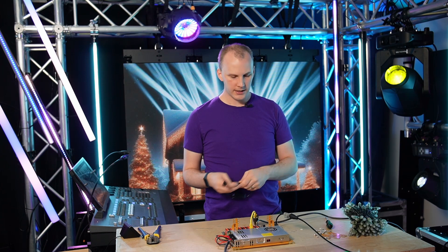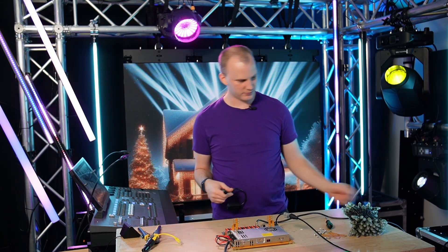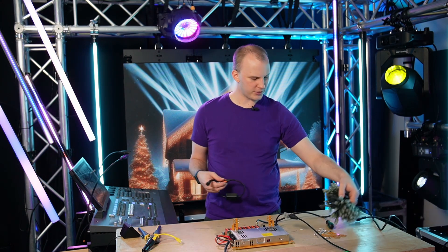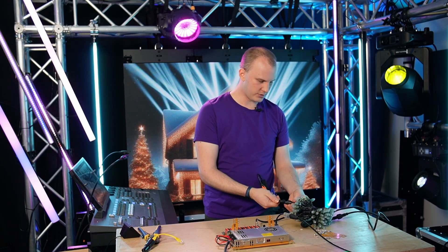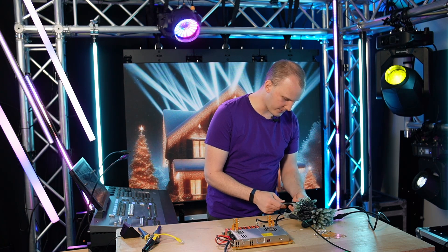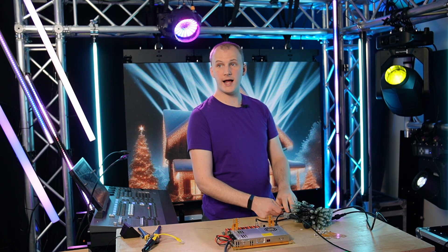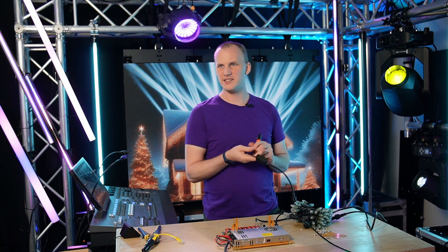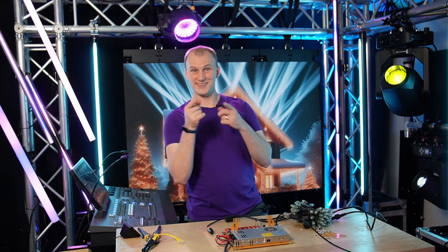So what I'm going to do here is I've gone ahead and built my own pigtail — a 10-foot extension with 100-count bullet pixels coming out of it. Plugging in my Pixel 2 DMX, and once we get set up and have a DMX address set, I'm going to run it out to this Dominar X right here and we're going to control it. We're going to see: is it really as easy as they claim it is to set up, and does it really work? Let's dive in.